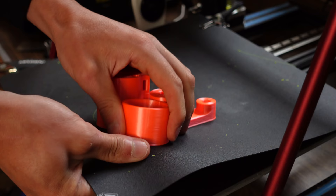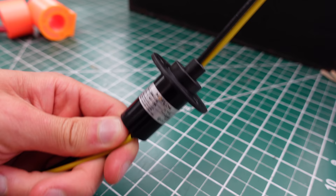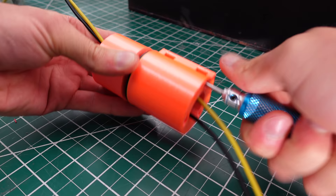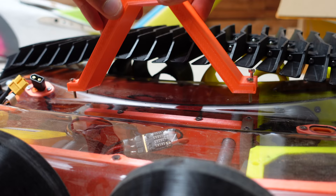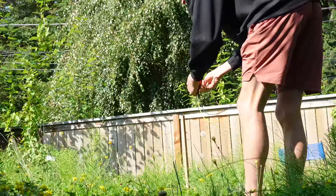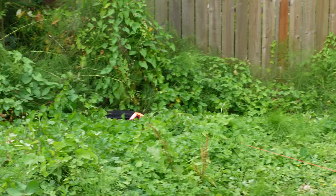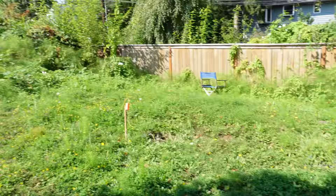After that I was back home and decided it was time to do a lifetime test to see how long this prototype would last driving continuously. So I built this little spinner thing using a slip ring, which basically just allows electricity to pass through while it's spinning. I 3D printed some parts and installed them around the slip ring with some bearings to bear the load, with a spinner arm on top. I hammered a stake into the ground and put the spinner on top with a string — this way it would just drive in circles all day long without any intervention. Pay attention to how my yard looks here because it changes a lot after this thing's been driving around for a while.